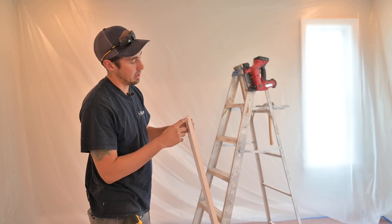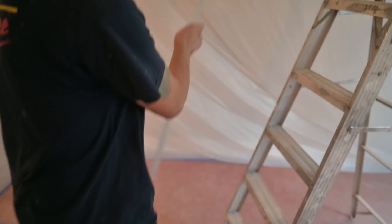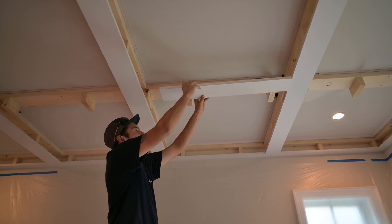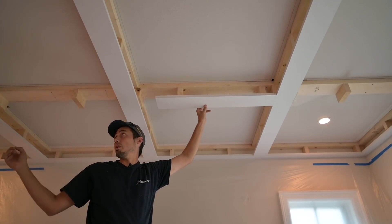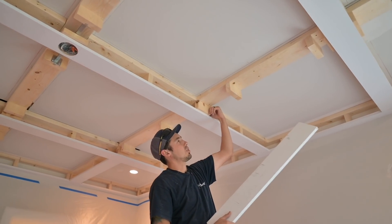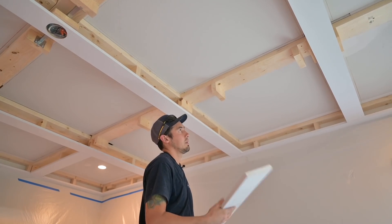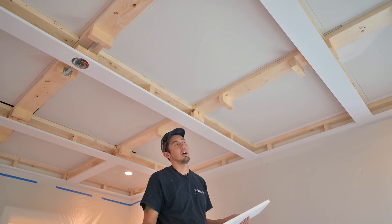What you end up with is basically a quarter-inch dado, instead of just your typical plunge cut from the biscuit joiner. Then you run your biscuit into there, install the board up here, and just use the mallet to tap it over into place — that's exactly what we did and it worked really well. We also decided to add some extra blocking, just nailed up, to help with alignment and give us a nice glued joint. I'm always up to try new things and experiment on the job if it's not going to mess anything up.